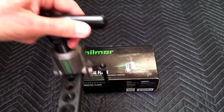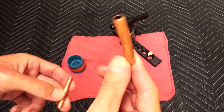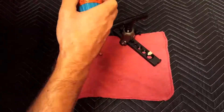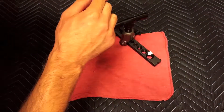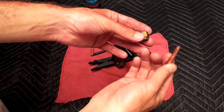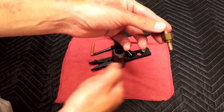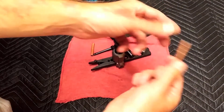So let's go ahead and see what this can do. I have a couple pieces of soft-drawn copper tubing here - 1/4 inch and 3/8 - and it's very important to de-burr these inside and out, so let's go ahead and do that. Now, make sure that you slide your flare nut over your copper tubing before you make the flare - very important step. For this demonstration I'll slide the nut on and then take it off, because this is such a small piece of copper it's going to be in my way.